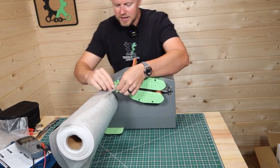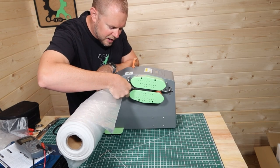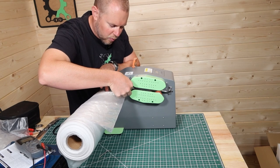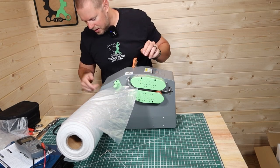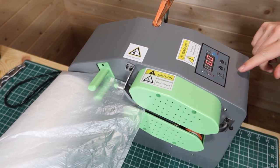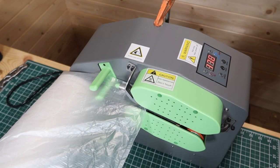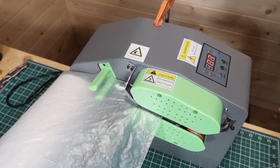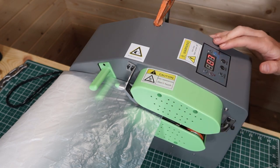Once I get this fed onto the machine, it will start to work right. I also slowed down the rollers way down so that it had time to fill the bags and heat cut them. Power first — let me check my settings. The speed is at 60, the temperature is at 180, and the wind is at 170. That seemed to work well. Let me feed that in a little bit. Now hopefully this is ready to work — let's give it a try. It may have to warm up a couple of times before it really starts doing its job.